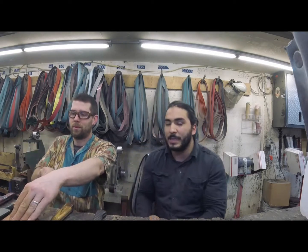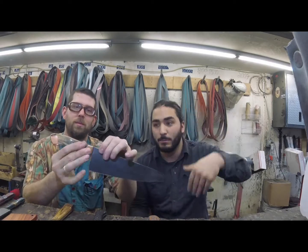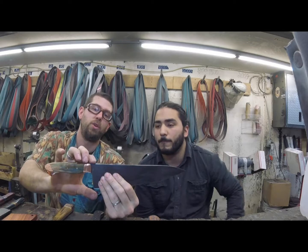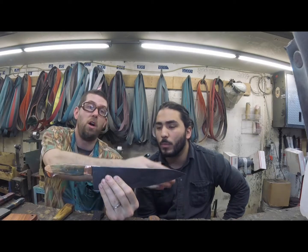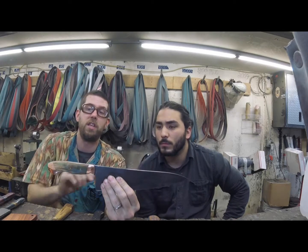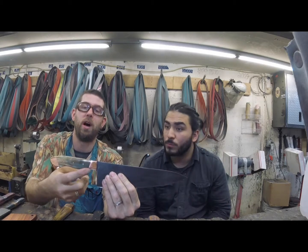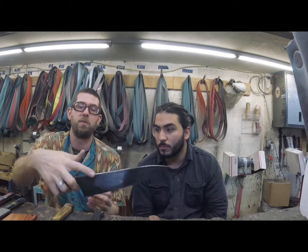But we do have an example for that, and that's going to be next. It is a pommel and bolster. And so, again, this is a 10-inch chef's knife with a 2.5-inch depth. So regularly, you'd have a lot of tip weight. And so you put some copper bolster and pommel back here. It really helps pull that weight back.